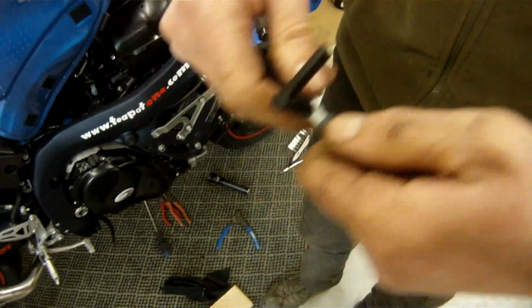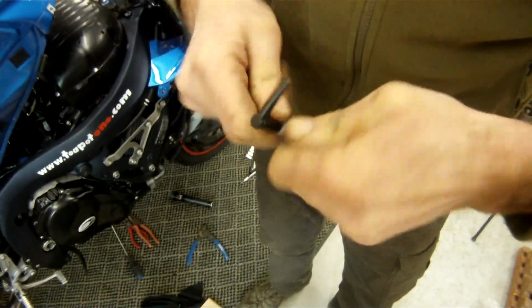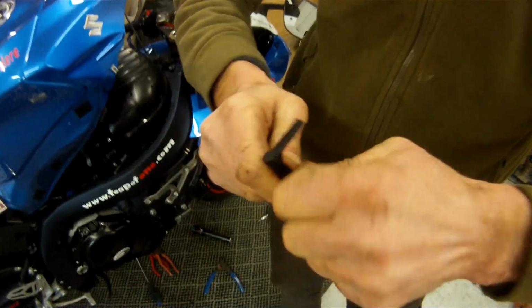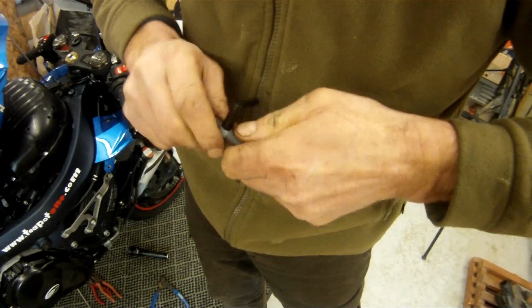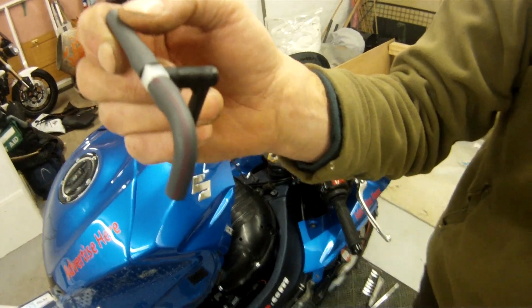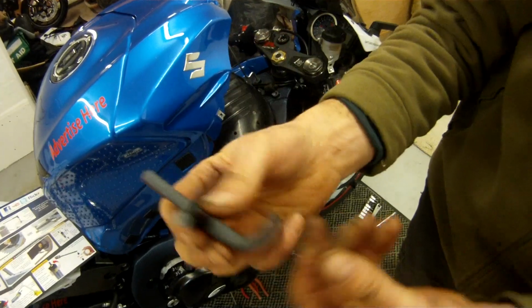Okay. All right, that is the vacuum hose taken off. I've taken that off the bike, cut into it. Easier to take it off the bike to do your cut, so you don't catch a wire or something important. Then you just insert the T-piece, a little white or light grey plastic T-piece section. It's a grey hose with a red line up it. That's one of your vacuum hoses, and they just go to all the different cylinders.